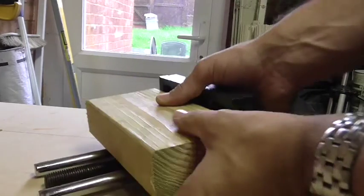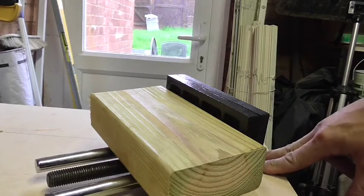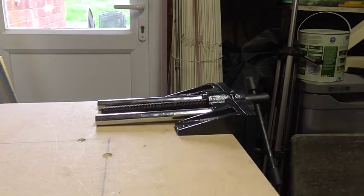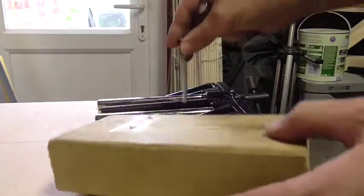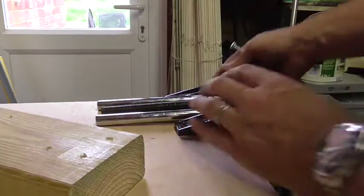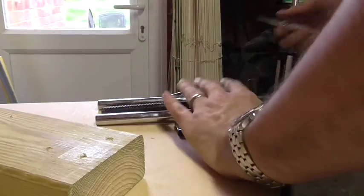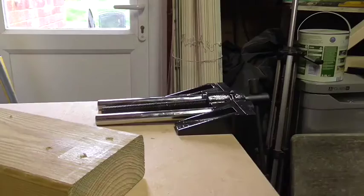I'm probably going to put some bolts through it because this is pretty heavy, and if it's holding a heavy workpiece it will need something more sturdy, so bolts that are recessed are going to be the way forward. To fit the vise to the worktop I'm going to bolt through the timber into the vise right through the top of the worktop so it will hold it nice and securely. To mark where I'm going to need the bolt holes, I've lined up the vise where I want it on the tabletop and I'm using this automatic center punch to mark where I'm going to drill the holes.